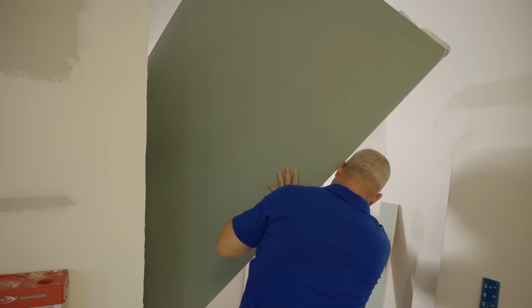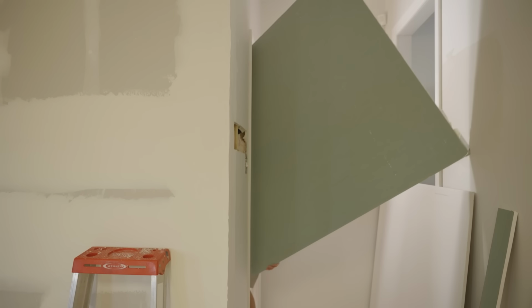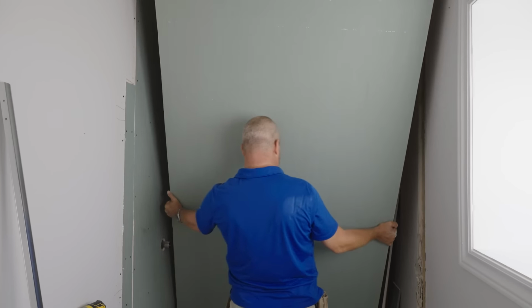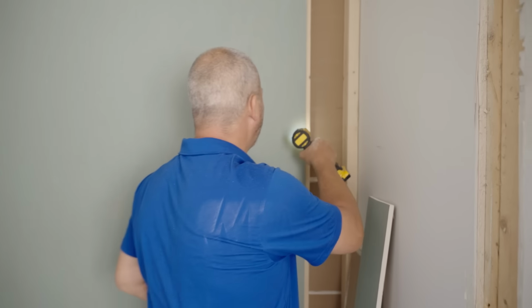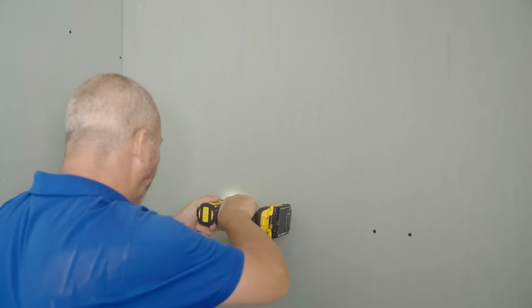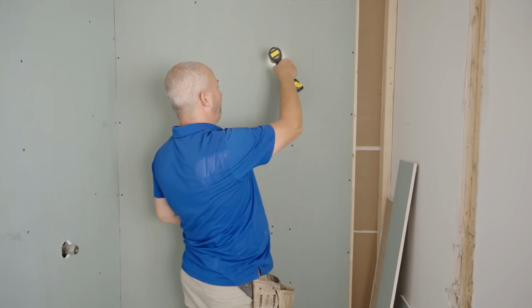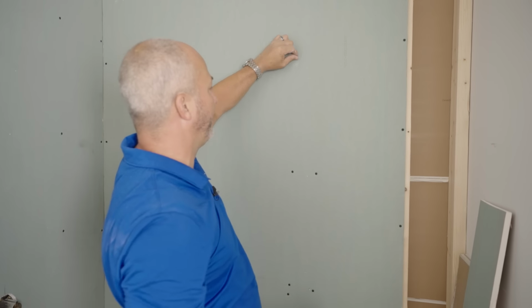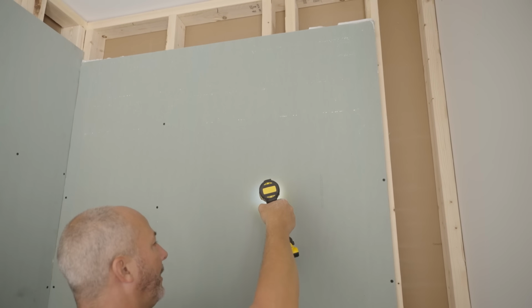This is a problem, isn't it? I got wires in here I gotta be careful of. Not bad. If when you put in a drywall screw and you just miss and it's not working out, put it in reverse and lift up. Pull the screw out, okay? Double check your line. Oh, I'm a little to the left. Use the same hole and just put a little angle on it.